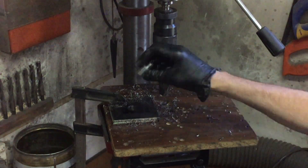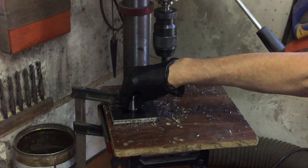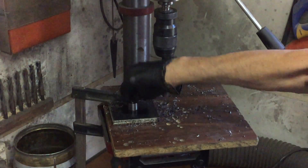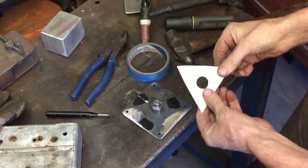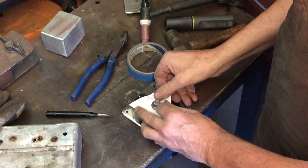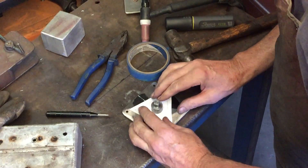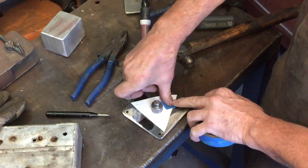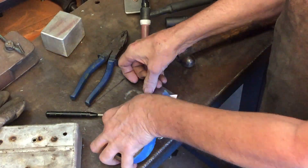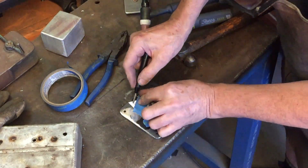The chuck has a 22mm hole, so my little adapter at 22mm fits into the plate perfectly. There are three mounting holes in the chuck, and to make sure I get the holes in the right place I've just drawn a triangle with the points where the holes should be. To be sure, I'm sticking it down and then I'll center punch those holes.